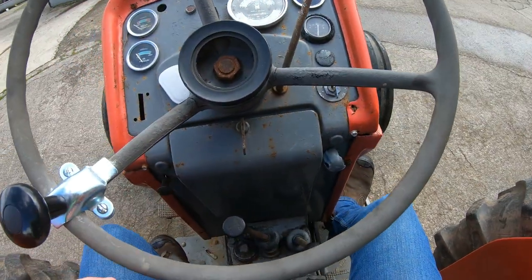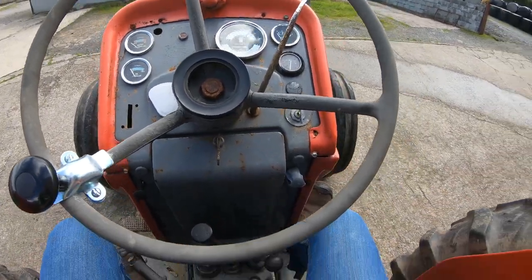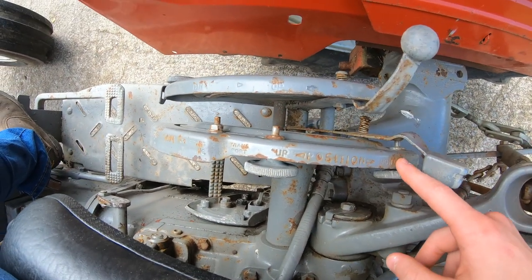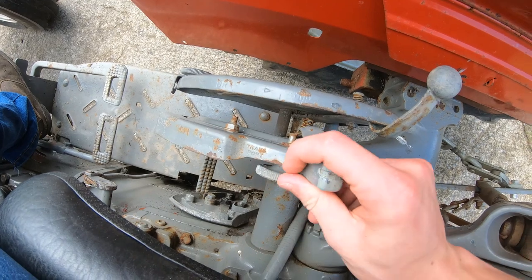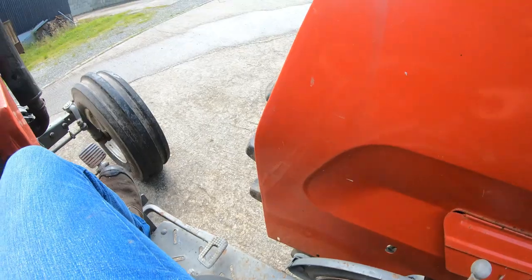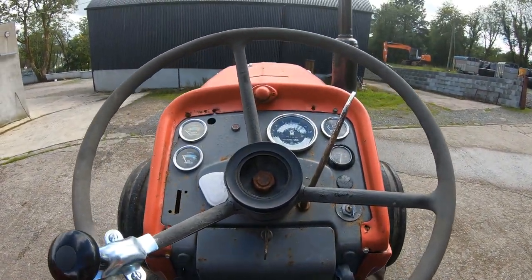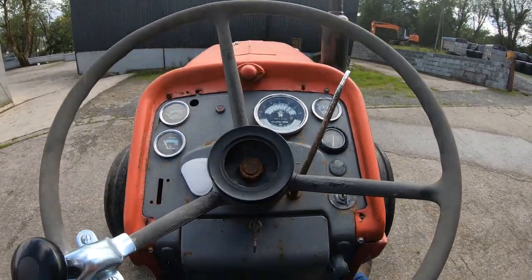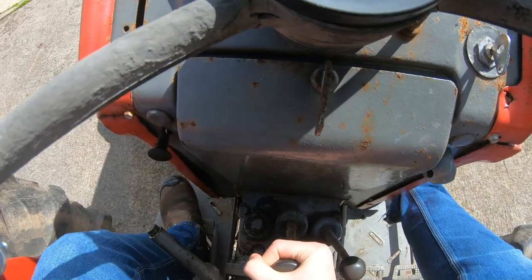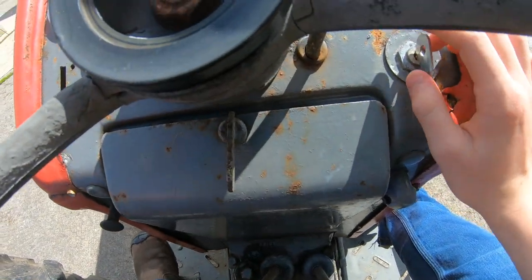This is mostly the same on the 168, but I said I'd show off the 168 as well. Then we have here - you go down, position down, up, and then you have transport and constant pumping if you're on the road and you need to lift it up more. I'll start it up now and just show you bits of it working and dropping the hitch. Once I do the tour of the 168, you'll see the way you have to take it out of gear and put it in neutral - whereas on this one you can start it in gear.